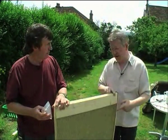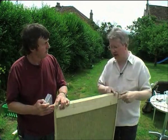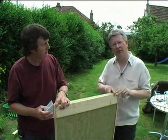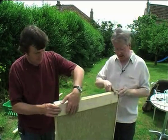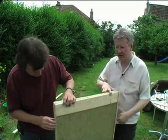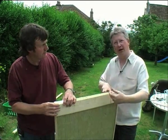I'm making the traps to go up on the ceiling. This is a standard rockwool slab, 1200 by 600, 30mm thick, and we're going to use some bags made by a company called Ready Traps. The fabric cloth bag goes over the top and they're provided with these little corner pieces, but to make it easier to hang, we've cheated slightly by cutting little wooden battens to run down the sides and across the back at top and bottom, and we're going to use those to screw in some eyelets and hang it on some strings.